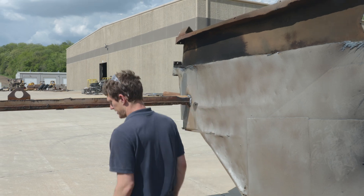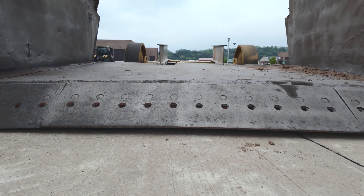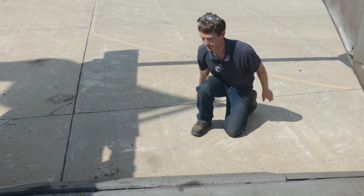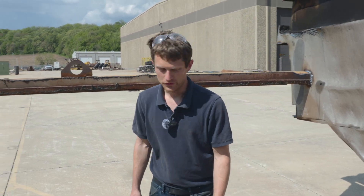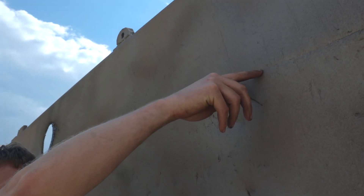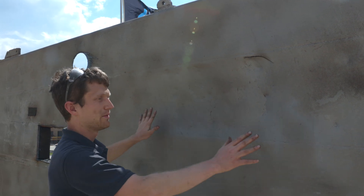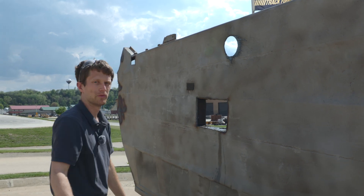One of the major things — what we call the cutting edge of the scraper — this whole floor is deflected by about an inch and a half. The contractor probably hit a big boulder and this whole bowl floor just pretty much deflected upward about an inch, so that was completely compromised. On the outside of the side walls you can see Caterpillar's cellular design — there's no support between the two weld joints, and scrapers, excavator buckets, and other equipment hitting the side wall completely oil-canned this structure. We could just patch it up and put a facade plate on, but when you put a sheet of steel on top it'll just potato chip from the welding involved.